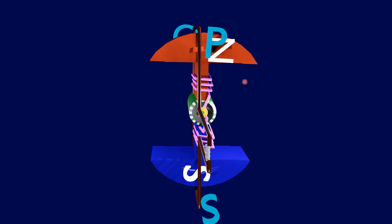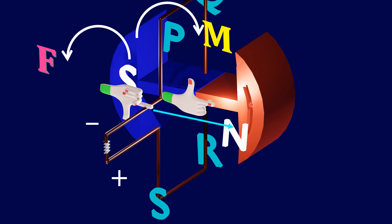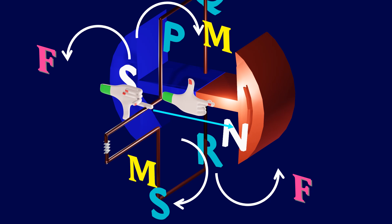For rotation from 90 to 180 degrees, the EMF becomes 0 because the magnetic field lines are again perpendicular to PQRS. Applying the right-hand thumb rule: for PQ, the south pole moves upward so the thumb points downward; for RS, the north pole moves downward so the thumb points upward. The middle finger points outward for PQ and inward for SR. So the current flows along SR, QP, and we place a positive sign at SR and a negative sign at QP.